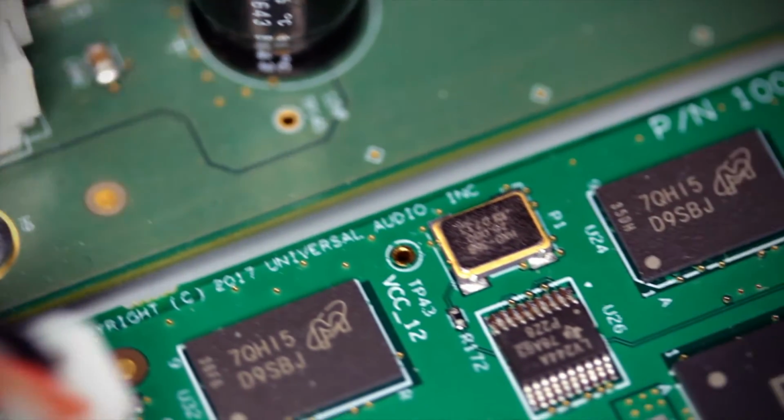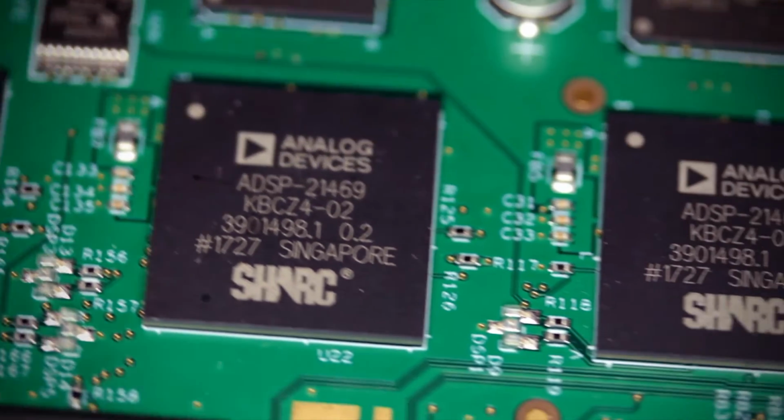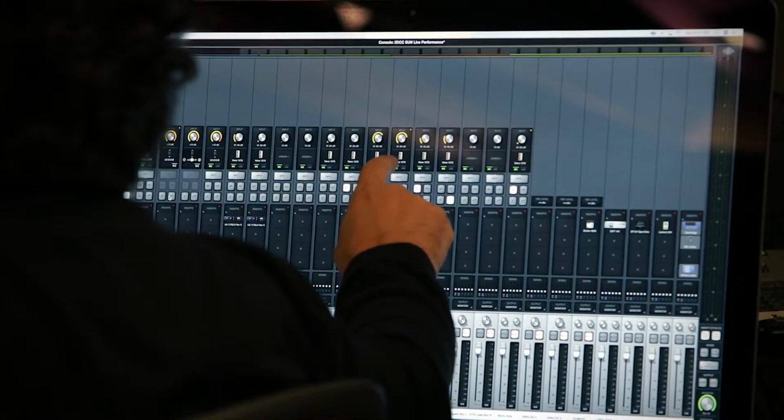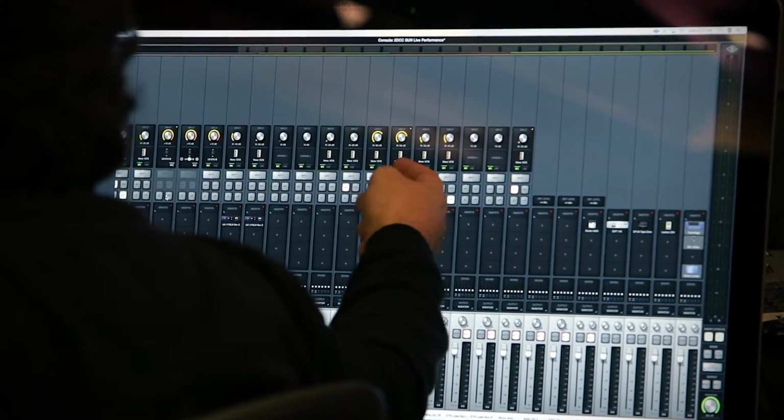So now it's 2018 and computers have just gotten more and more powerful. Why is HEXA DSP, or DSP just in general, still important to users? That's an easy one to answer. Real-time audio. Yeah. So really the only way to produce a deterministic latency and I/O count and plug-in count, for how many things you can actually get, is to put audio through DSPs, digital signal processing. They're only doing one thing. They're focusing on completing an audio task in a number of samples.